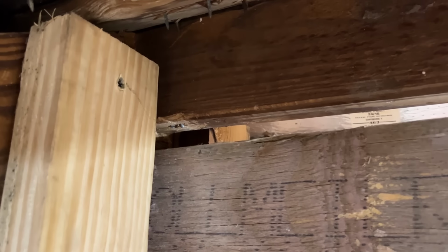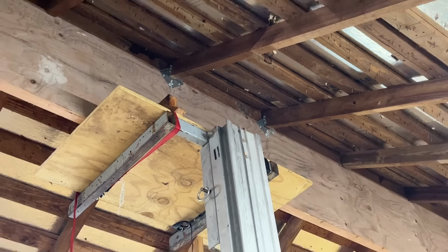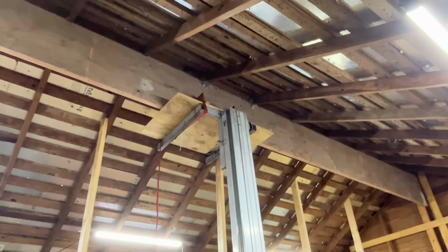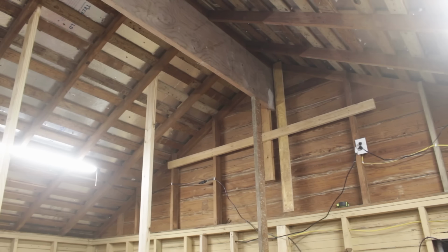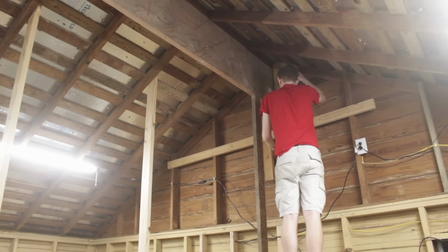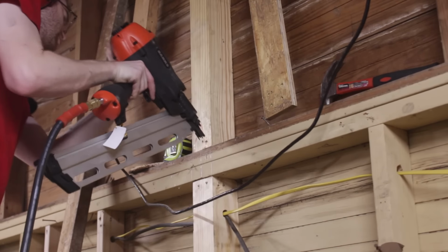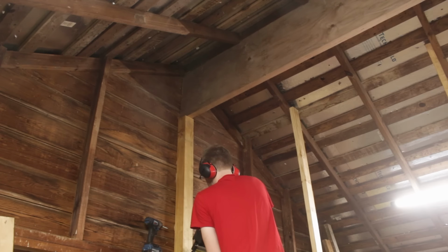Unfortunately, there is about an inch gap between the beam and the ridge on the ends, which means that the roof did end up sagging just ever so slightly. But that's nothing that a jack can't fix. Then it's just more measuring, cutting, adhesiving, banging into placing, and nailing. Same story for the other side.